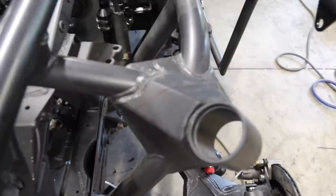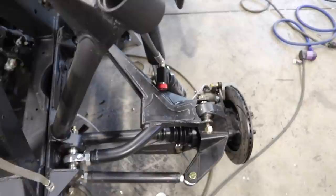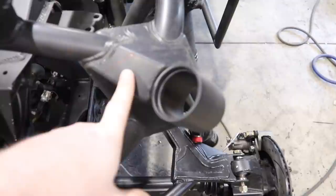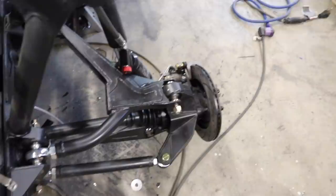Now that's done, we need to move on to modifying the bump stops. Our bump stops need to go down a little bit more. Now that we made all these changes, we know exactly the travel of our axle and we need to limit the suspension earlier. We need to cut — you can see where we've made a cut line already. We're going to cut it off here, move it down, re-box it in a cool looking way, and adjust our bump stops down to stop the suspension from snapping our axle on our frame.